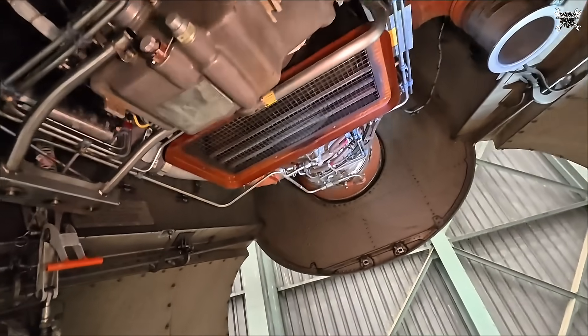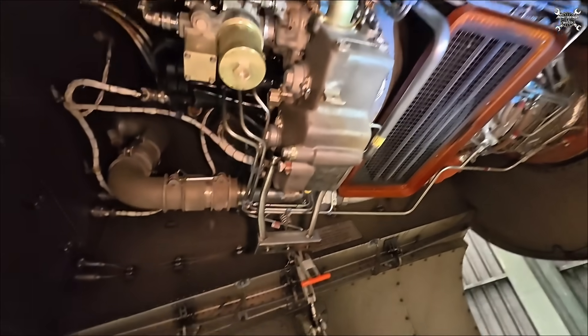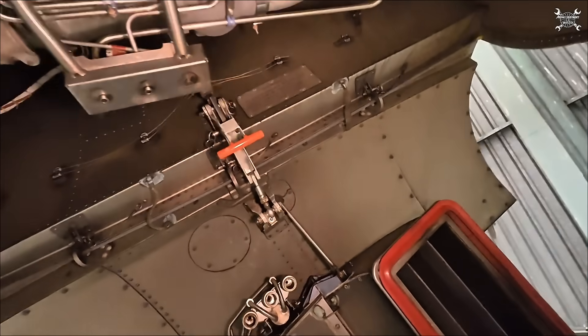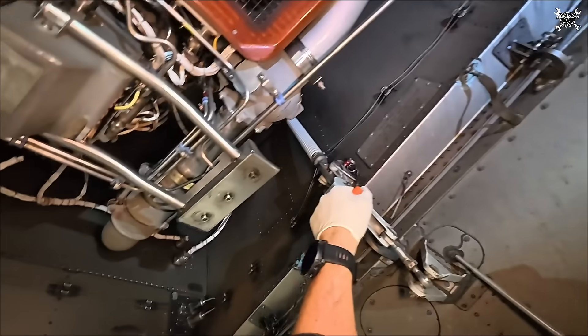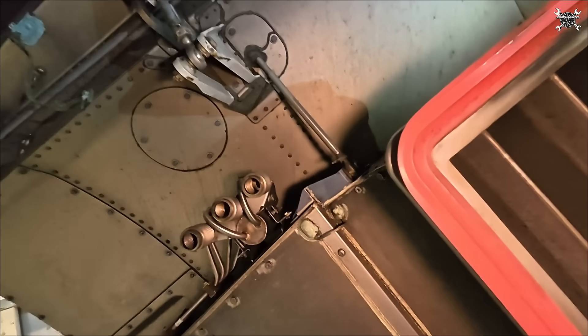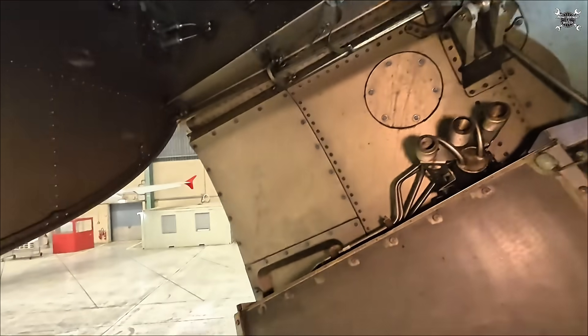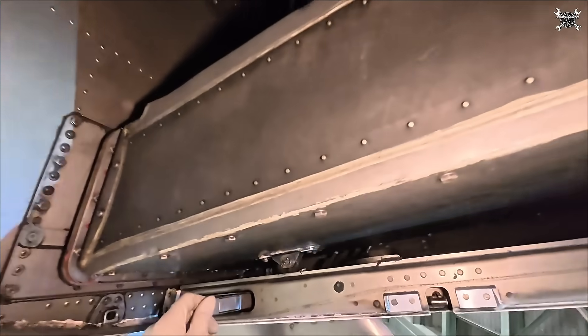Two bonding leads, one on each side. Remove the muffler, bleed — done. Very straightforward, very easy. If you're good, one and a half hours and you can bring the APU down. It's only a couple hundred kilos — dry weight is 136 kilos or 299 pounds. Many people struggle with the doors for some reason — you just need to hold the door, push the lever, and the doors will close easily. They're spring-loaded so you don't need much force.